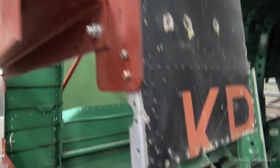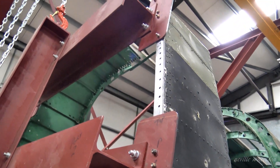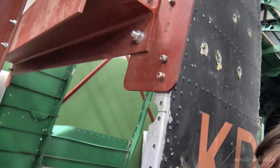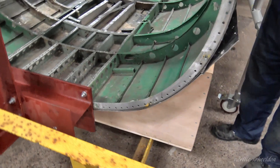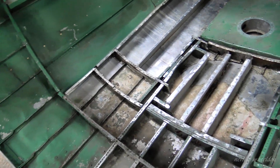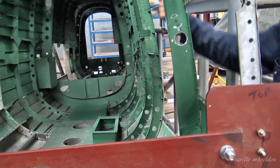This former is pretty badly damaged — is that 27? Yeah, we'll have to replace that. Most of 28 as well — we'll have to replace most of that. And all of 29 of course, because it isn't there. Former 30 has a bit missing there. This bit here is homemade — it should go all the way up to there; that's badly done. But the Canadian ones are formed in the sides, so we can change them in quarters.